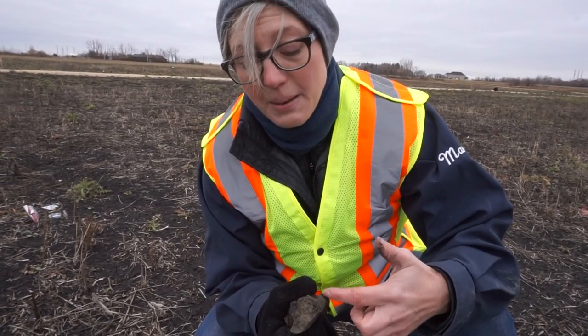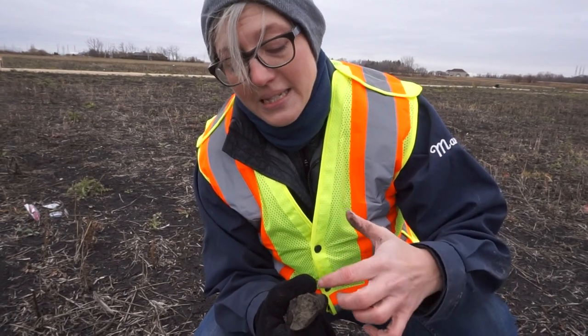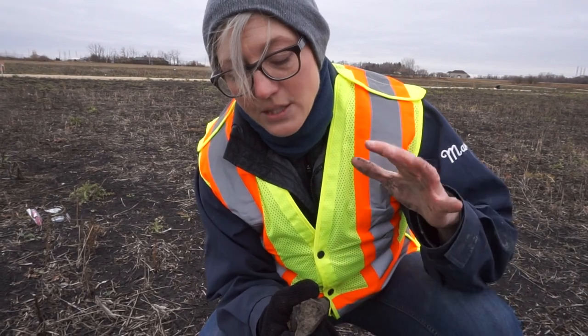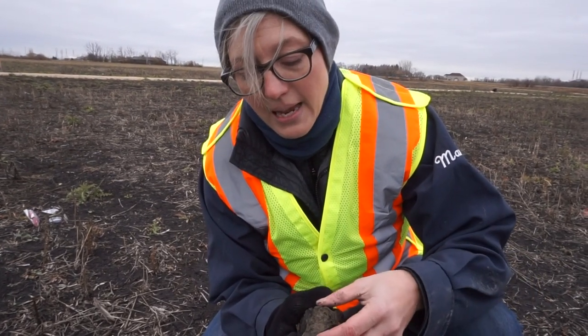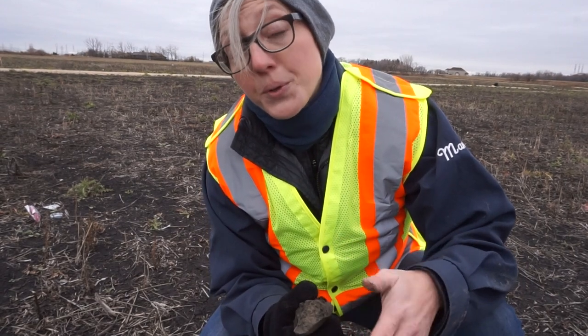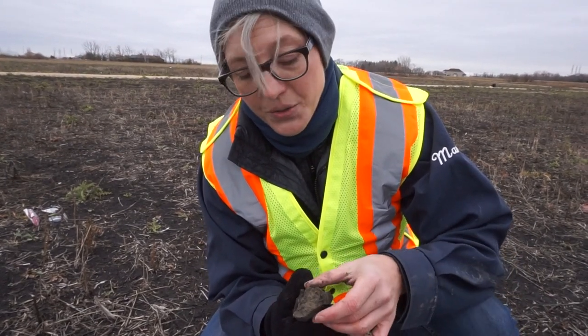The soil is doing the same thing. There's iron in the soil that gets wet because it's a heavy clay or there's a high water table, and then as the water dries away, it gets exposed to oxygen again and leaves that rusty color behind. So it's an indication of drainage — when the soil is either poorly drained or imperfectly drained, not a really well-drained soil.